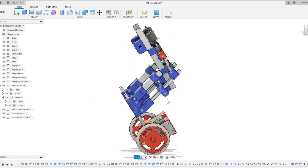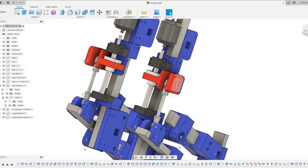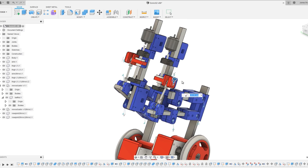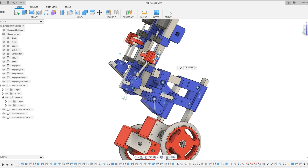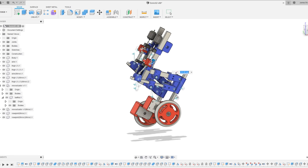This is my main mechanical structure. We've got two knees that bend, operated by ball screws which slide up and down to operate each knee mechanism independently. That gives the robot the ability to lean sideways as it goes around corners, and also lets these legs act as active suspension.